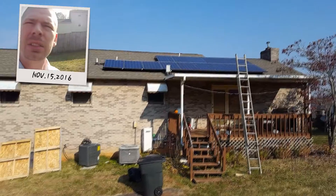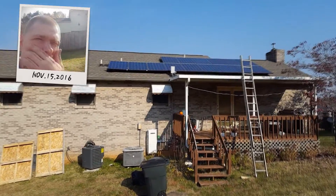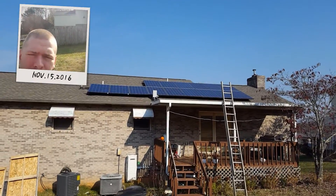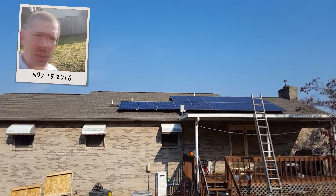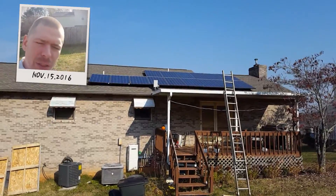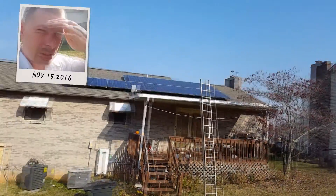Let's go outside and take a look at the energy production on the roof. Here are our solar panels — they're up on the roof doing what they need to do. There's 3,750 watts of solar installed, and with the Midnight Classic controller they produce about 2,700 watts during full sunlight days.